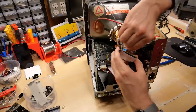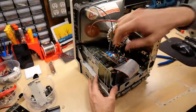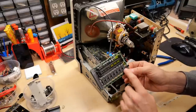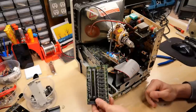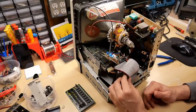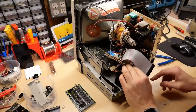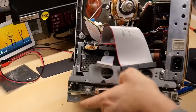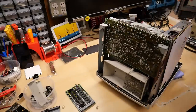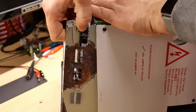Let's pull the neckboard off here — it had a little bit of goop on here, just peel that off. We'll need to pull this expansion board out. This is a regular Classic with a RAM expansion board — it's got one meg of soldered RAM and two more SIM slots, so this machine supported a total of four megabytes. Pull the hard drive off. Here is the power connector to the motherboard. There's debris leaking all over the desk. The motherboard should slide out, but it's stuck because of all of this corrosion — it's sort of welded itself onto here.